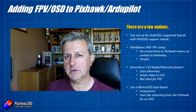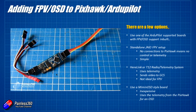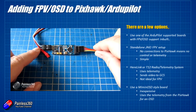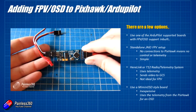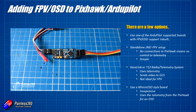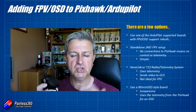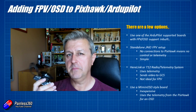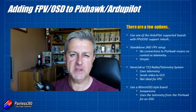That is where the last option comes in. This is a Minim OSD — these little boards are relatively cheap and cheerful, but require an awful lot of setup. Links below. If you really like to play around with code and have an FTDI adapter, this potentially is still an option. You plug it into one of the telemetry ports on your Pixhawk or something like the Durandal. The pin outs are the same. You plug it into the telemetry port, make sure it's talking Mavlink at the right speed, and the Minim OSD will overlay that information onto the video coming in from the camera.